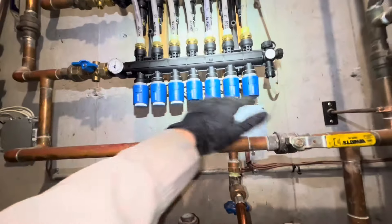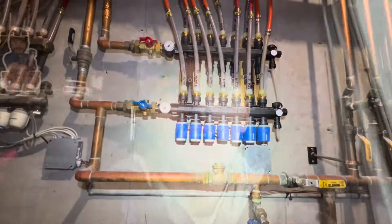I want to get all the radiant zones turned on to make sure we get heat coming up. He's up and running — he has radiant heating and everything seems to be working. However, there are three other circulator pumps that are either failed or on their way out. We're going to come back and replace those three circulators. I couldn't use what I have because of the orientation of the pumps and the way the flanges are currently. I don't want to install a pump the wrong way because then we'd just be back sooner to fix it. We'll come back with three pumps and install a purge valve, set up so we can use it for both circulators for that heat exchanger.